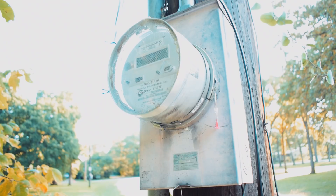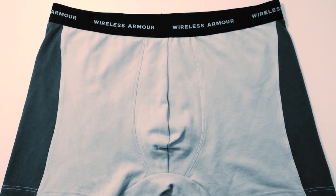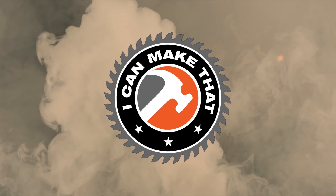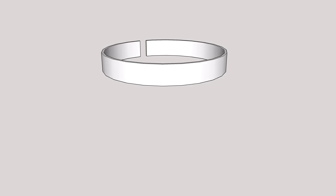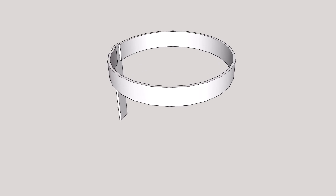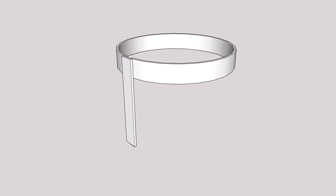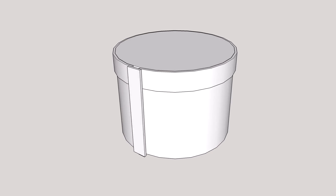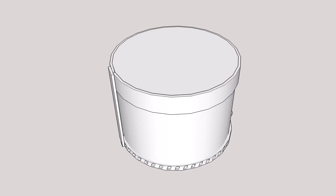I'm going to build a Faraday cage to stop those pesky RF emissions from my smart meter. My idea was to take one-inch flat bar aluminum, make it into a circle, put a spine on it made of the same flat bar, wrap screen around the inside and across the top, and then attach a hose clamp to the bottom part that would allow me to clamp it onto the smart meter and make the shield.